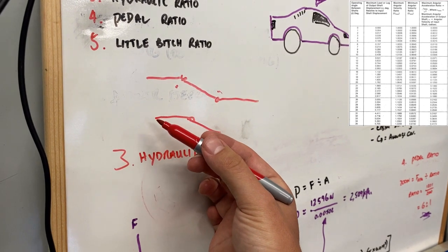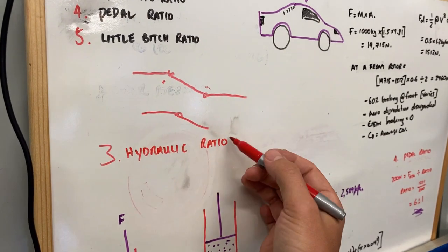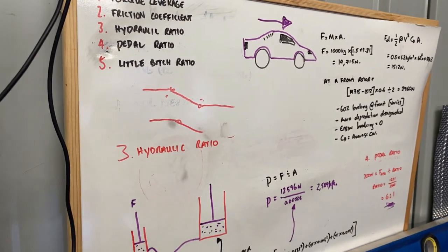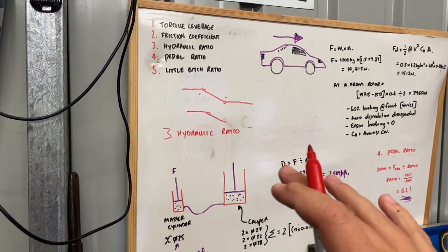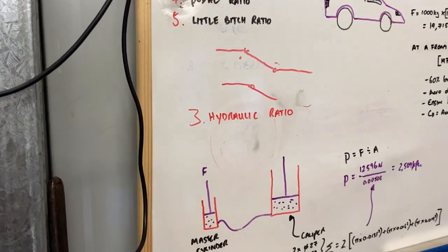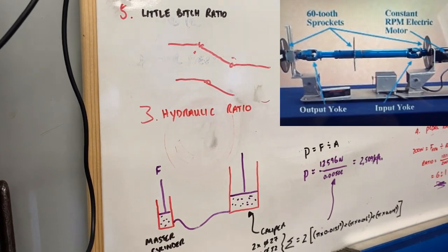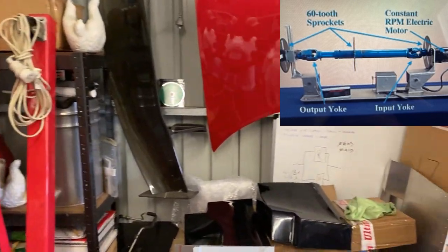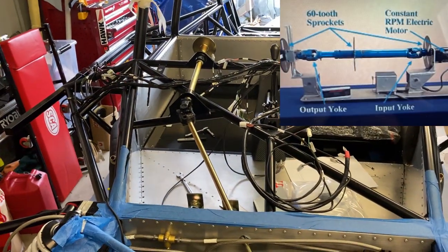The force on this input will vary as well. So what we need to do with this steering arrangement is try and get this angle and this angle as close as possible. There's a spider on the lens there, sorry about that. But that's best illustrated by a short video I'll attach in the description — it has a constant velocity electric motor and you'll see that the intermediate shaft will vary in speed.